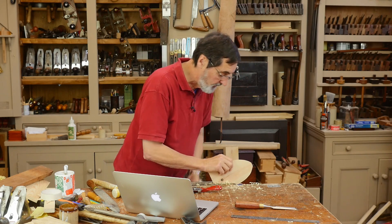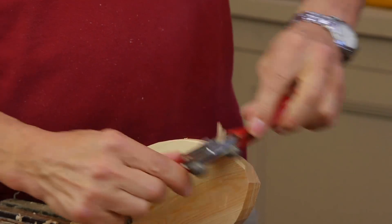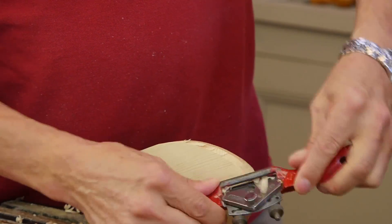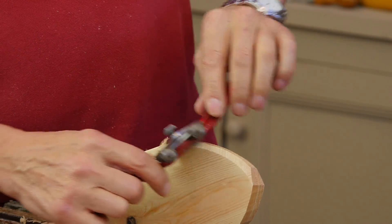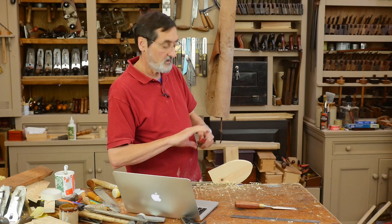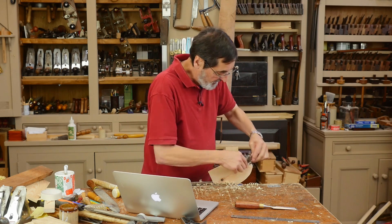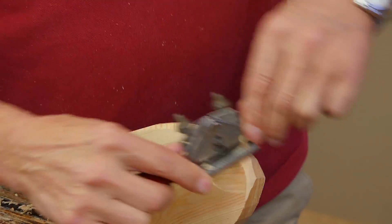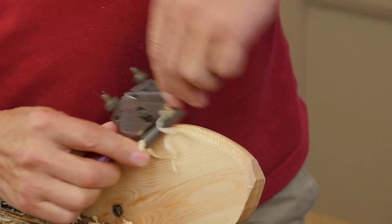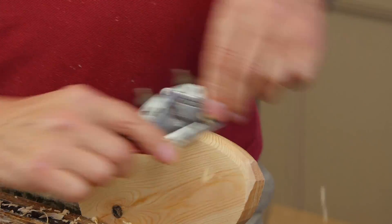Then you go in on the hard edges and just round it. This is wonderful for learning to work with the grain — which way do I go? I'm going against the grain here and it's still working because I've got a sharp spokeshave, but this feels wrong — you can hear it, I'm stroking the cat backwards. We've got to go the other way, taking out the damaged edge, then take the corner off again.